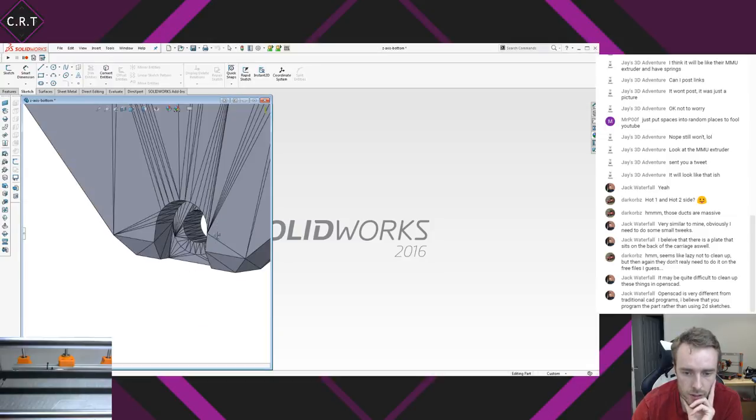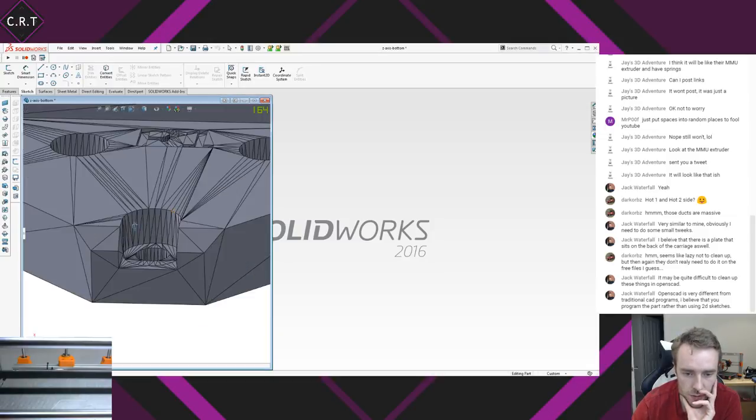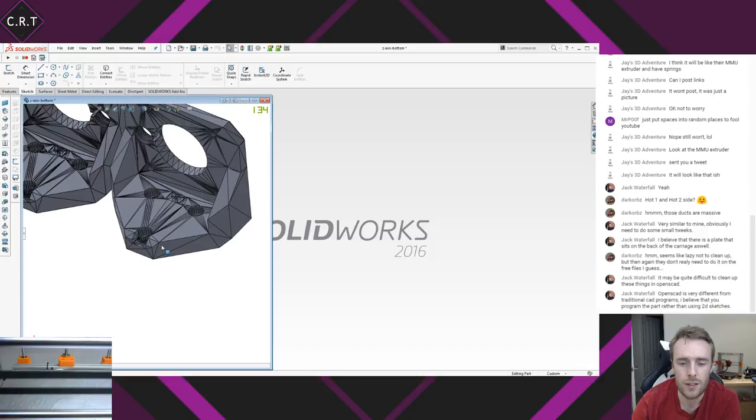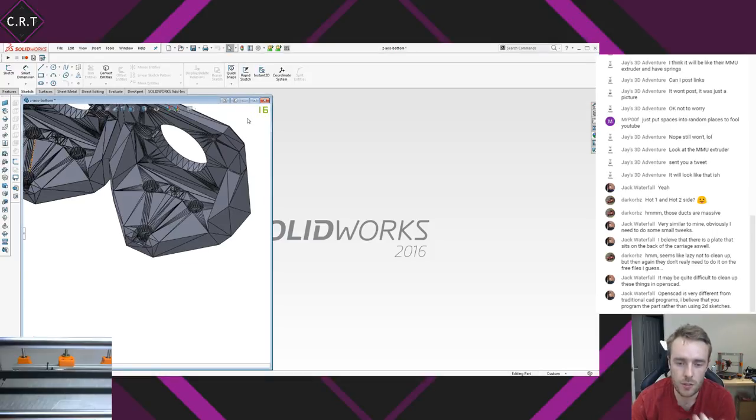I would have liked to actually see some change to this area, because I don't think this really works very well. I think it's a bit silly having that screw right where the wires come out of the motor. It just seems a little bit daft. It is what it is, I suppose. The way you change it would be to have a longer motor, which you don't want to do because that's more money and you don't need to spend it. Or you move the hole on the part, which you also don't want to do because that makes all your backwards compatibility no longer valid. So you just end up with this scenario where they're both on top of each other and you just have to make do. But they should at least do button heads.